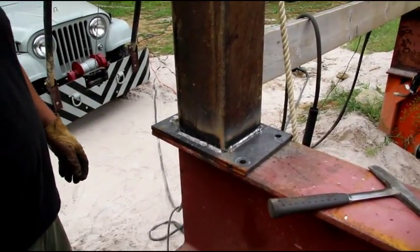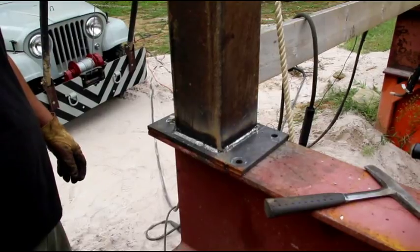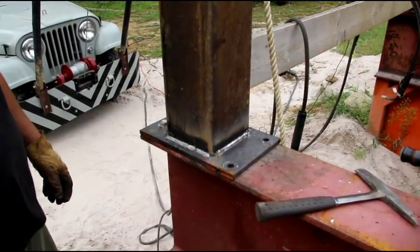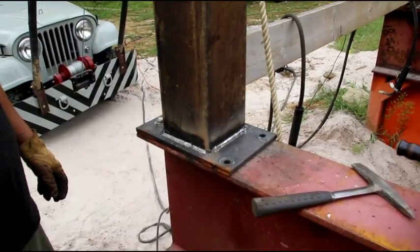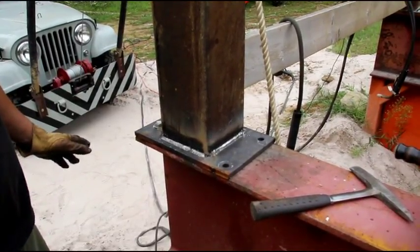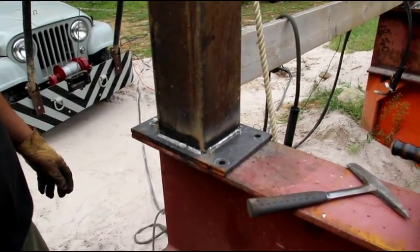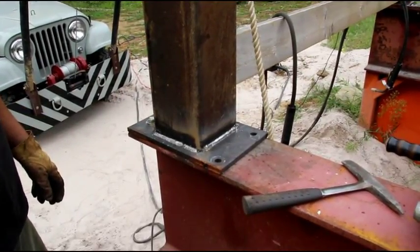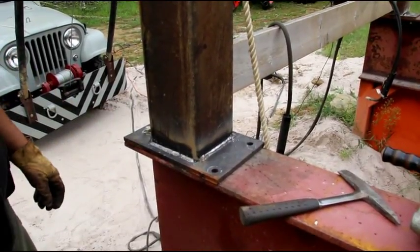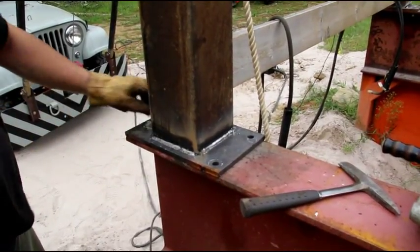And this is the Hobart XLR8. I like to use that 72 thousandths thick. And it's a good structural wire, and it meets codes and stuff. There's nothing wrong with the wire, and it's much faster than the 7018. So we're going to switch back to that, but I hope a couple of those arc shots are what you guys were looking for, a few guys that asked me.